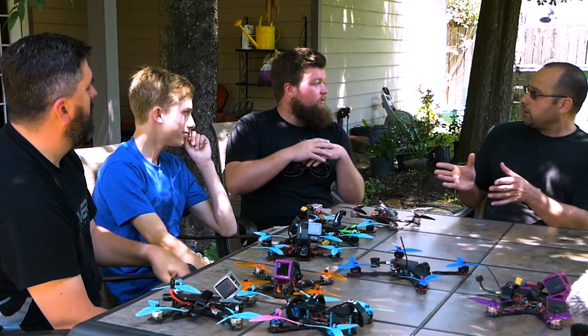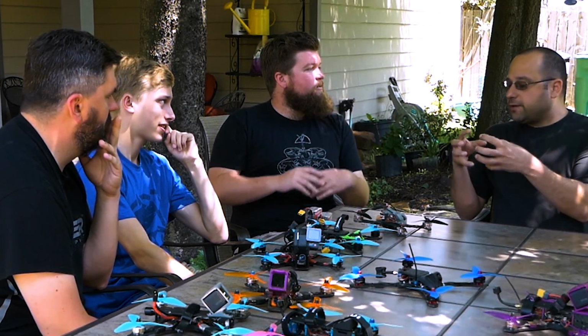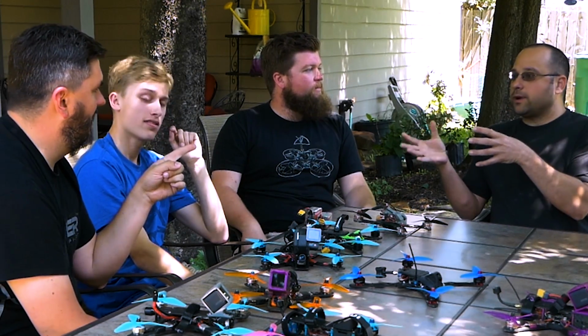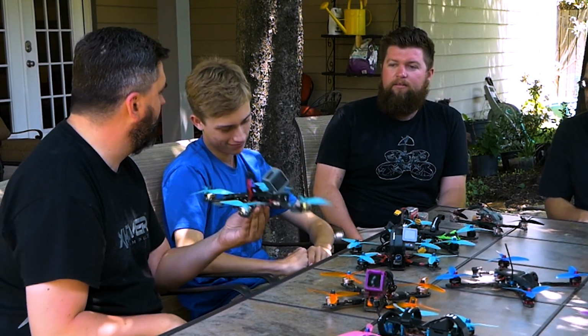Now, up to a point. Eventually it's so light it becomes fragile. We see a lot of guys trying to beef their quads up, and by adding weight, they actually make it break more. This was a big problem all the way back in 2015. You had people building really, really heavy freestyle setups that were all the way up to like 800, 900 grams, and they'd be like, but it's going to be durable because it's got this thick carbon fiber, and then they'd crash and be like, well, why did that 6 millimeter arm explode? Because you weigh like a kilogram.